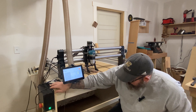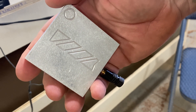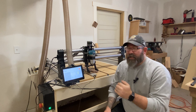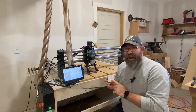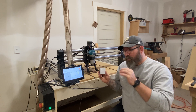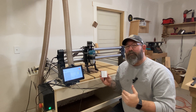First off is a touch probe. I have a separate video where I talk about how a touch probe is actually used. Basically, this is used to find the X, Y, and Z of your workpiece so that when you load your program, it knows exactly where the wood is and where to start cutting — it's the origin point. I prefer having a touch probe because it allows me to precisely find the X, Y, and Z, which comes in handy especially when you're doing tool changes and have projects that require a variety of different tools.